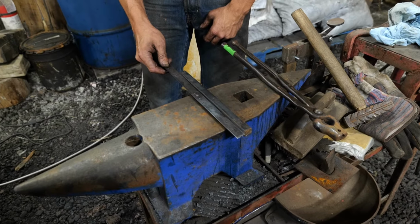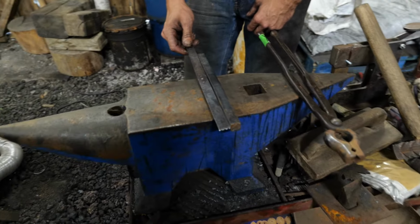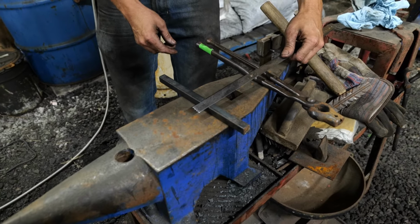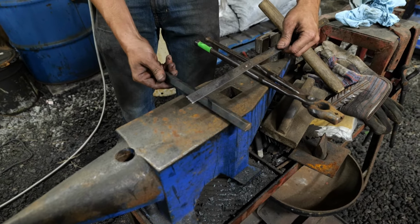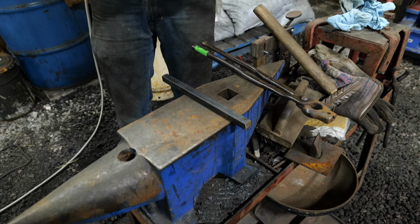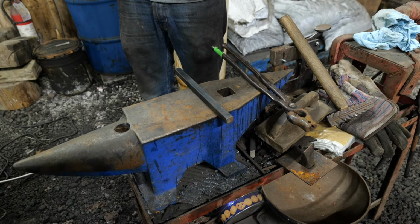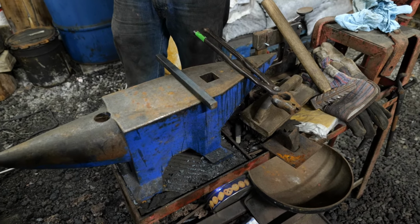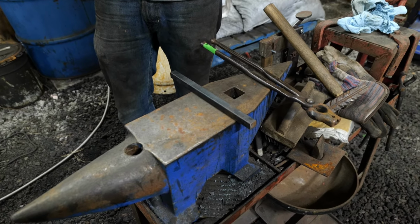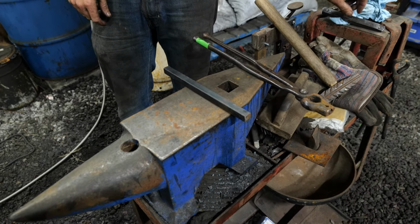Okay, the starting size of this handle material that we're going to start with is a 10-inch long piece of 5/8-inch square. So that's going to be the starting point of this. The previous mirror, I believe, was 1/2-inch square bar, but again, we're making it a bit larger, and so we need a handle that's going to be proportionate in the long run. So we're going to start with 10 inches of material for Thomas's end of starting to forge this handle.